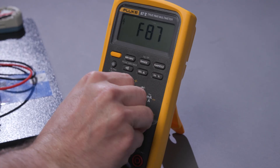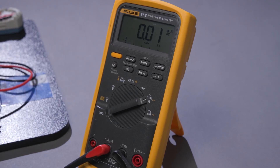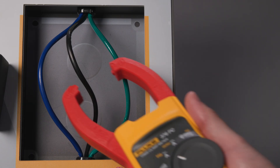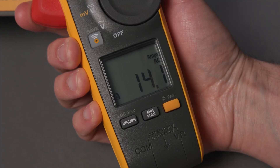To measure DC current, you'll need the right tools. A digital multimeter or clamp meter that can handle DC will do the trick. Just spin the dial to DC amps and make your connections. To take the measurement, you've broken the circuit and placed the DMM in series. If you're using a clamp, just clamp around one conductor and it'll give you the DC reading when you're in DC mode.